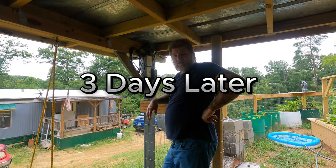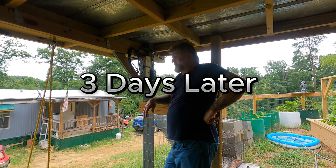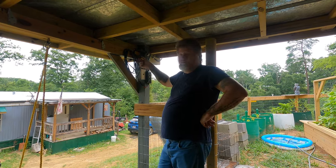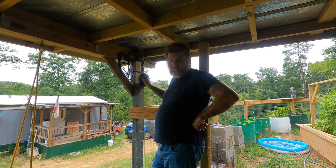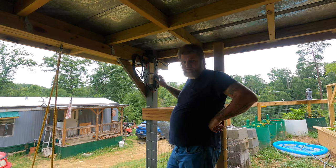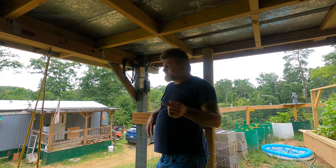Alrighty, guys, I just want to throw an update on this video before we publish it. We've had this thing up and running for the last 3 or 4 days now. And it's worked flawlessly. You come out here and you kick the solar on, you hook your battery up, and it charges it. We don't have enough panels to push it to its max performance. It's supposed to put out 20 amps, and we don't have enough solar panels hooked to this to do that. We hooked the generator battery to it for like a day and a half, 2 days. It charged it just fine.